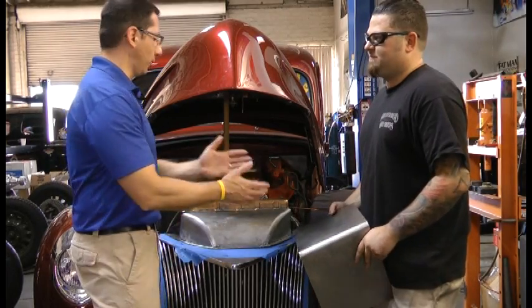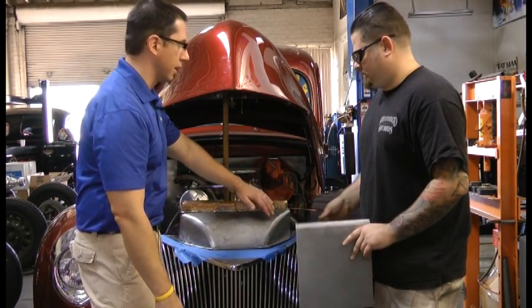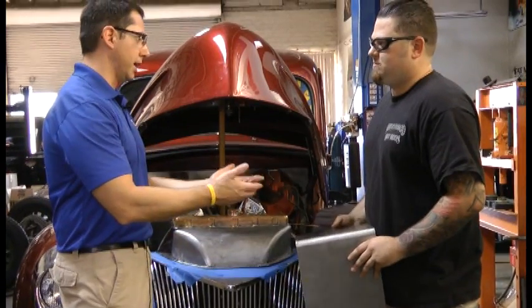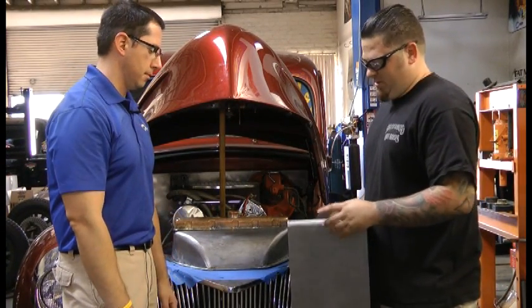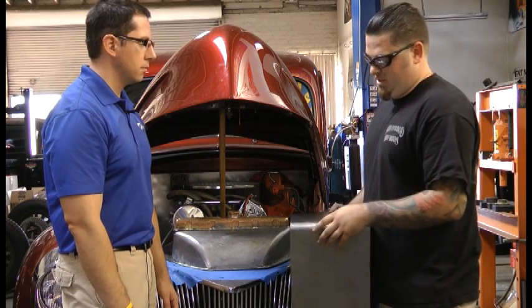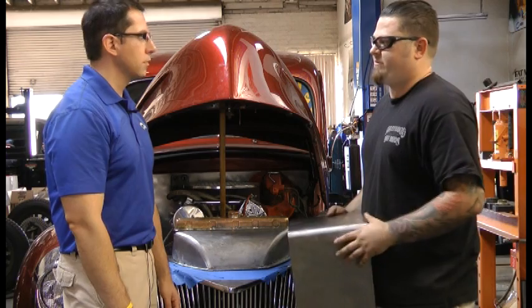Obviously we didn't create an entire upper fan shroud, but basically what we did here would be similar to what you guys had done on this corner. Yeah, it'd be exactly the same process. So now why did you choose MIG again, just to recap? We did MIG because it's quick and it's going to keep our heat affected zone down, which is going to keep our warpage down, and we weren't going to hammer this anyway, so MIG is perfect for that.